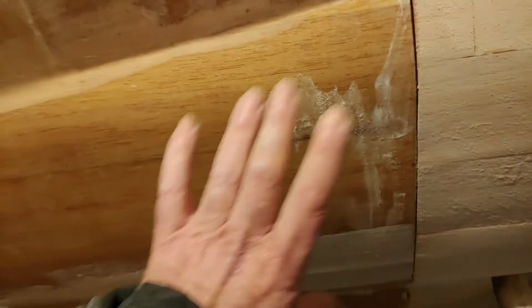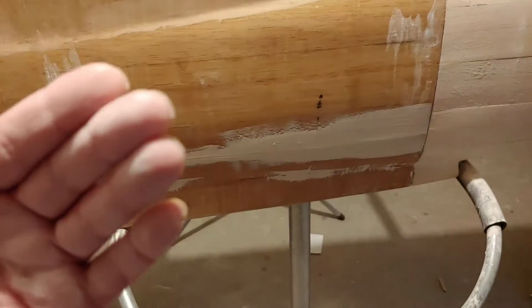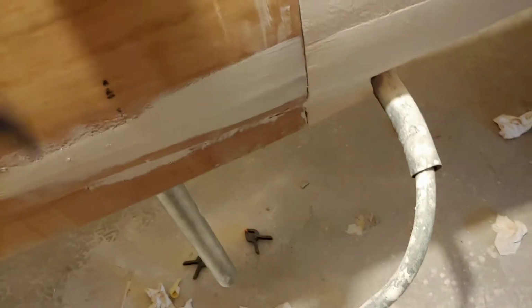So if I make them out of fiberglass, they're going to be a lot better for filling with foam, and then I can use the Dremel to go in there and hand carve them out, and we can glass them and get them to look like they're right. But the one main thing is you want to make sure that you're absolutely centered. Now, our scale wheels will only come in to about right in here, but the door we're making will actually come back into here, and there's a space about that wide, and you've got two gear doors. They'll come out, and then you have another, and then you're going to have to make this little piece right in here work for you.